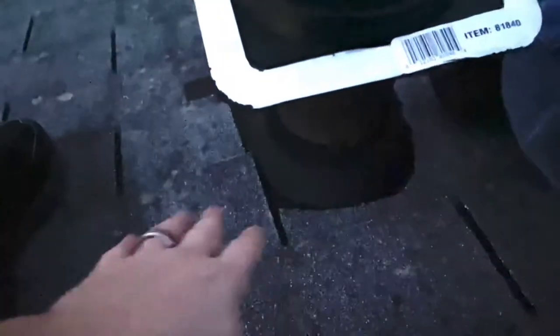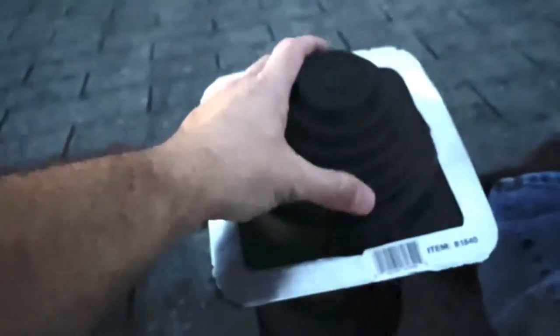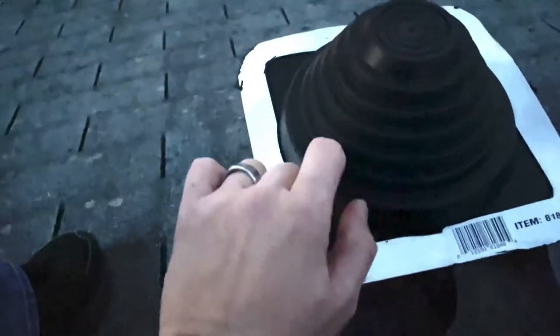Let's go ahead and place this on top just to see what it will look like. I'm not replacing the old seal — I'm just going to be placing a new one right over the top, which is going to cover the crack and the dry rotting underneath and stop the water from going around it, down into the attic, and into the ceiling of the bathroom. It feels like I'm going to have to cut it down to here — I'll start there first and then we'll see what it looks like.